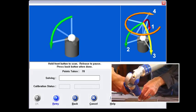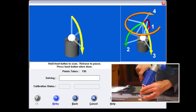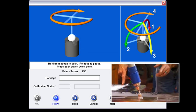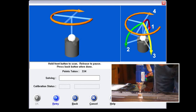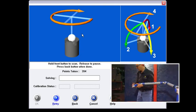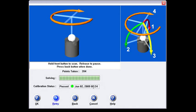Then I'll go into this other opening, punch the green button, swipe it past 90 and let go. And into this third opening — punch the green button, swipe up, and let go. If you had a six axis arm, you would be done now. But on my illustration, you'll see I've still got one rotation to do. So I'll take this last rotation of the seventh axis, push the green button, rotate around, and let go. Then I pull out and hit the red button. The software goes through and solves for the best fit point in the center of that cone.